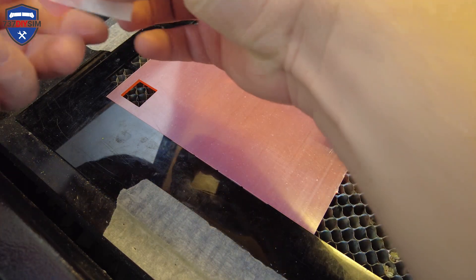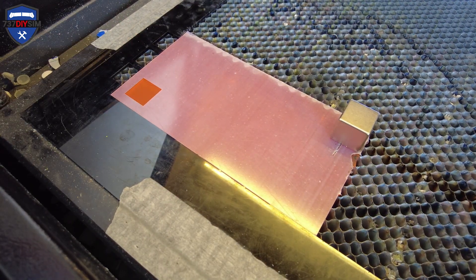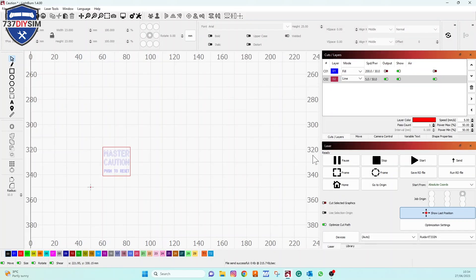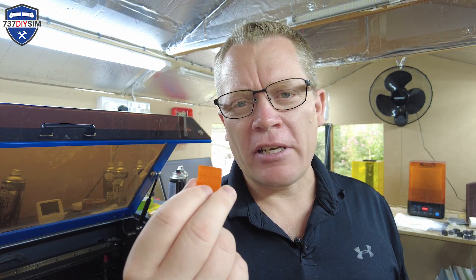With it cut, all we need to do is flip it over and put it back in. We head over to the computer and change from the outline to the fill, which is going to engrave now. All we've got to do is hit start — away she goes. And there we go, the master caution caption is all done. Now we don't have to worry about that fiddly protective film on the front because it's already removed, which means we can go straight into wax application. But before we do that, let's make the fire warning caption.